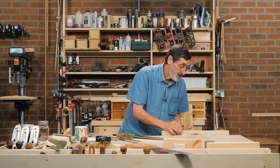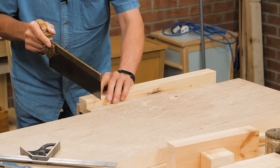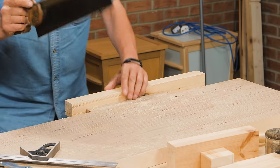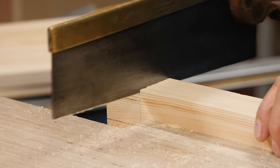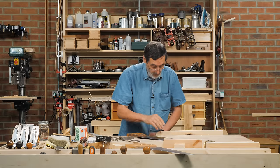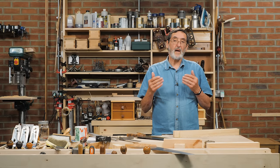You can do something else if you want: put a little step down with a wide chisel like this, just at the start of the cut. You can go all the way across if you want to. Then your saw goes right up against that knife nick and you lower the hand. I've got that square cut, now I drop my hand — drop, drop, drop — then back up to the top and square across. And I listen, because the pitch changed. And then I've got this beautiful shoulder line again — nice crisp line. This is my waste wood, so I was cutting on the waste side of the line. And that's how I would generally cross cut using any of the cross cut saws.